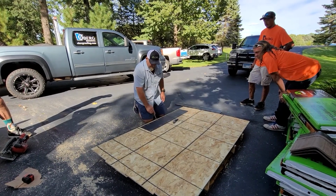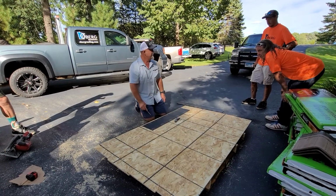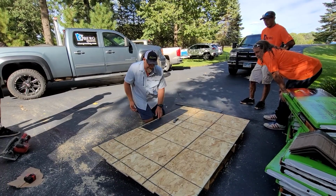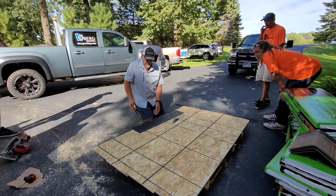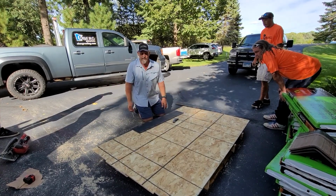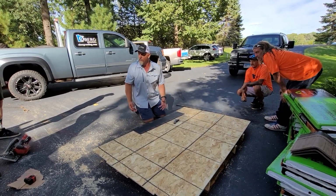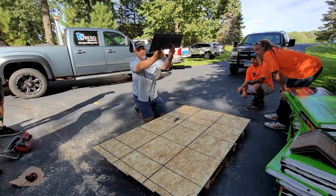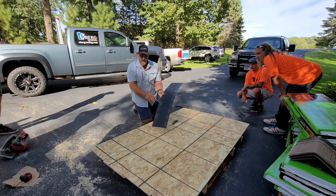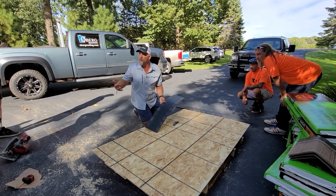So this would be covered because there'd be a shingle, this color would be here, and then it would be open so it matches in. Make sense? So if you get that product, you're going to line that up. If you don't get that product, you can just use as far as the black. See how there's a black right here? The black lines up just perfect. It sounds really anal, but again, you never know which type of homeowner you're working with, or you may end up having something really vertical, and what you don't want is, for instance, you're installing this shingle here, and you install that color showing. Okay, so that's my little 2 cents for it.